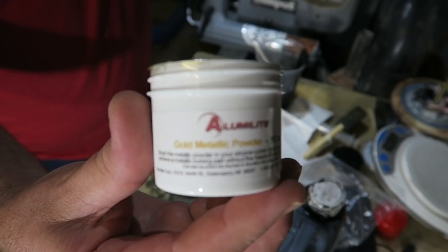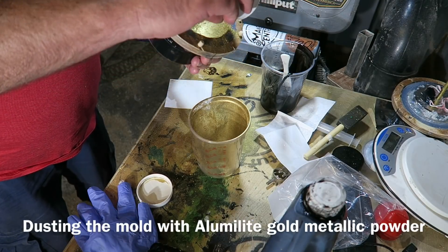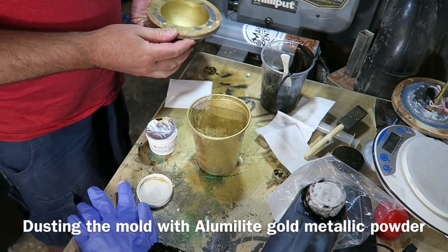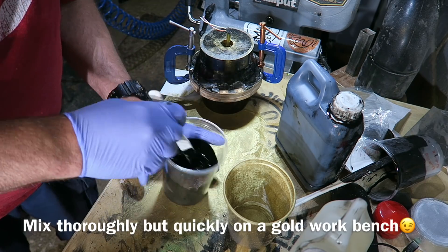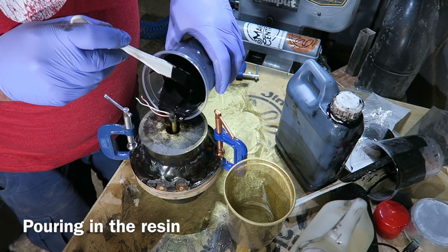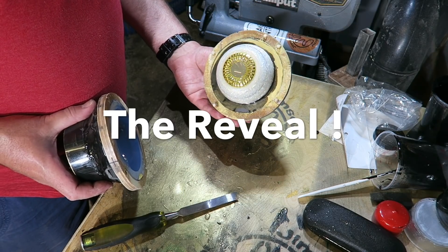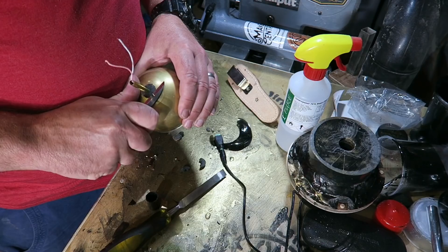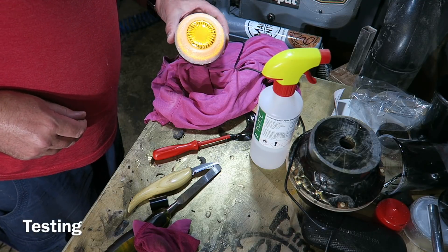Now I'm seating the light housing. This is a Luma light gold metallic powder for dusting the inside of silicone moulds — you dust the mould thoroughly then tap off all the excess, so I ended up with gold everywhere. Then mixing up some MPFG black polyurethane, mixing it thoroughly — you've got to work quick because it sets fast — and pouring that into the mould. This is after it's been in the pressure pot for an hour. The big reveal — really pleased with how that came out. Here I'm picking away the flash and trimming off the sprue at the back. Checking it works — yep, good result.